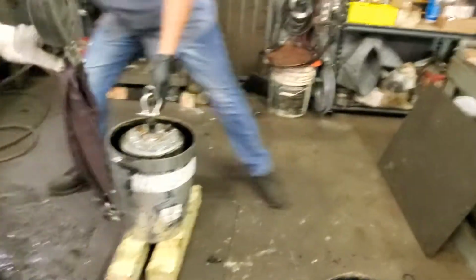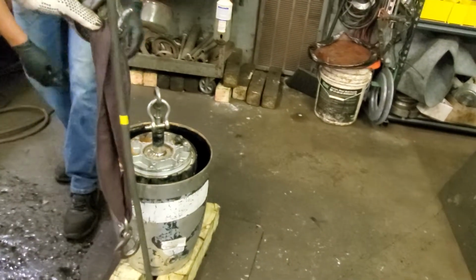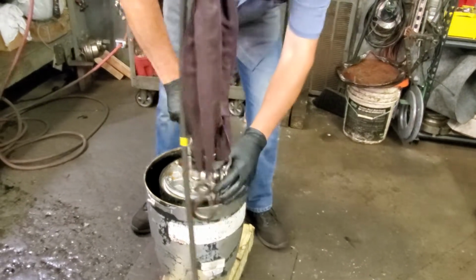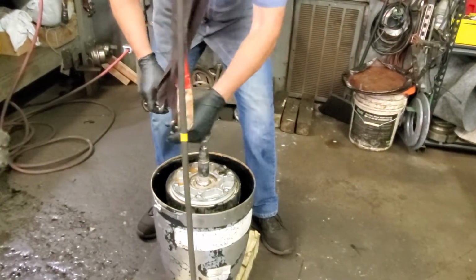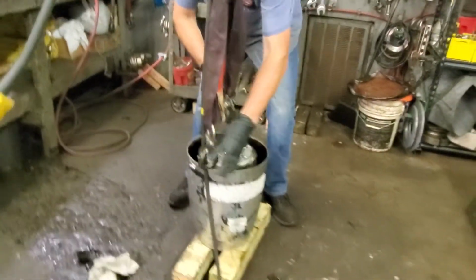Here you go, brother. I really think this pump probably fell over, right? Because it gets hot. Gotcha. Maybe not the seal fell, but the overturn. Because like this, in this case, the pump will overheat all the time. So they will trip the overload. Gotcha. Okay, hold on.